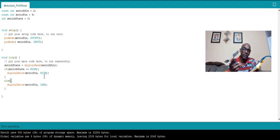And if I push the push button, then the pinwheel spins. When I'm not pushing it, it's off. If I push the push button, then it spins. So like I said, it's a pretty simple project, much like the first project, turning on the LED using the push button. The only thing that is different is that this project utilizes the transistor and the diode to create a gate to control the flow of current.